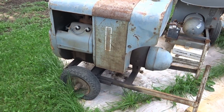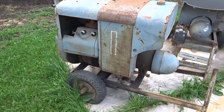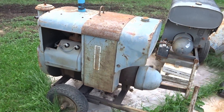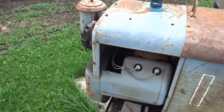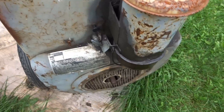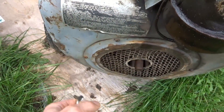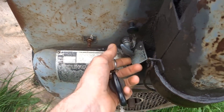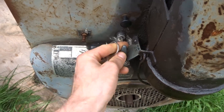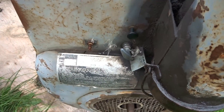This thing is a 1942, like an SA200 — it's a Junior Shield Arc. You start with a hand crank here, just grab it and you yank up and click the magneto. These RPMs when you adjust the welding current, pull it out and turn it — that's just the idle speed of the engine. This is the choke right here.